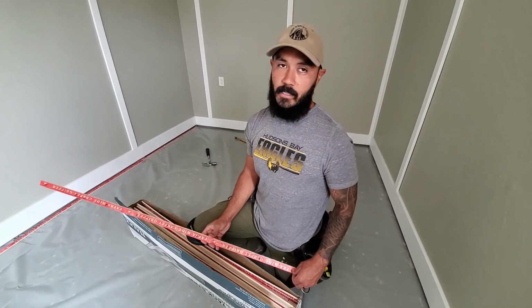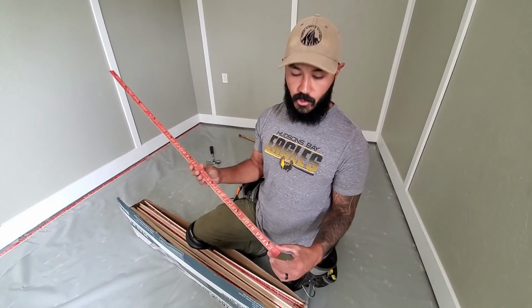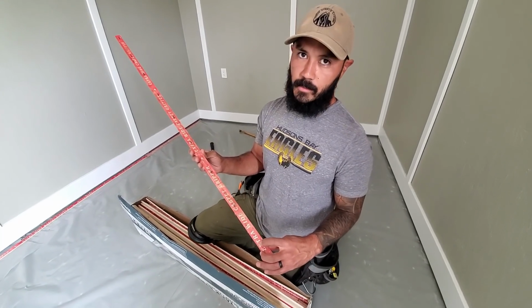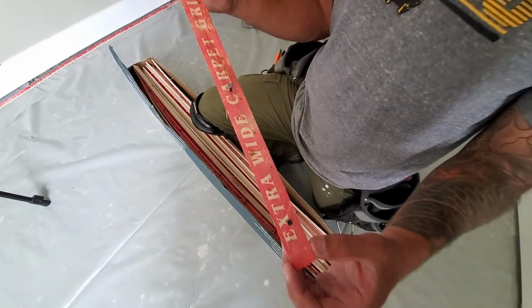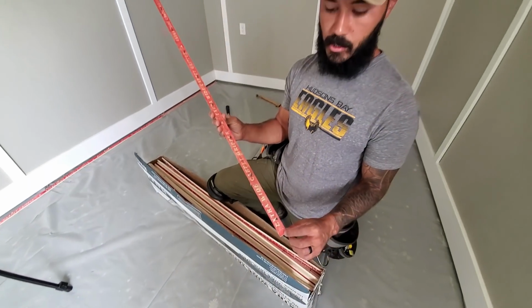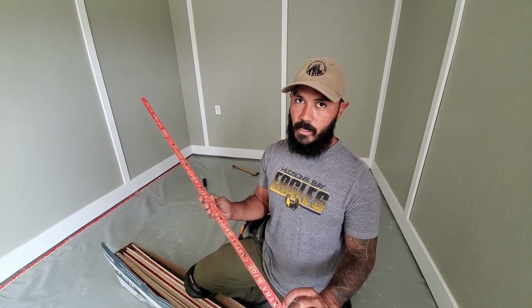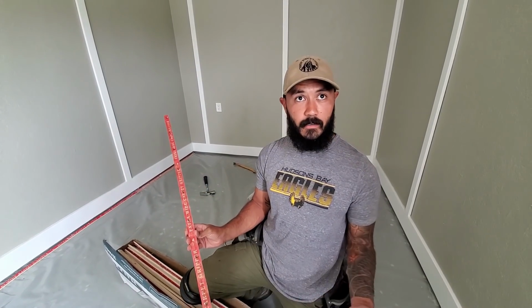We are going around and we are setting our tack stripping to the concrete slab. For that, we are using this extra wide tack strip that is made specifically for a concrete slab. Basically, you just pound these nails into the slab and it pretty much gets set in place that way. With the extra wide strip, we're hoping to utilize the little additional tongue portion toward the edge of the strip to staple down our pad. So once everything's installed, we can get that done.